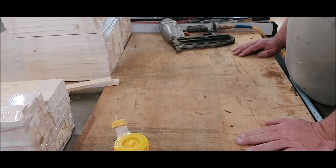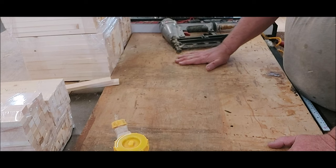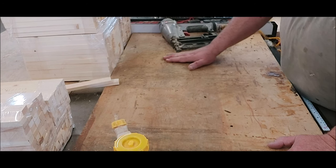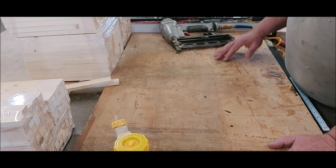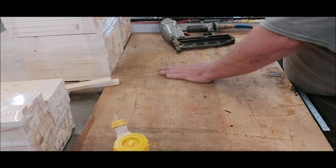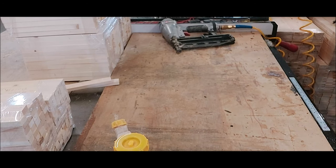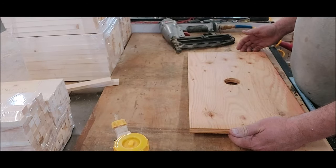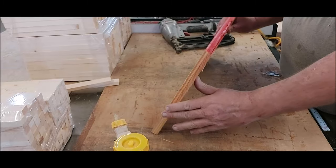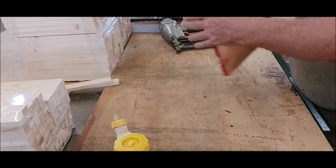Okay, I've got my sacrificial work top here, just a piece of plywood that I use. I like a surface that's flat and not a lot of glue knobs sticking up on it. There get to be drops of glue that stick up, so I've taken my chisel and scraped it fairly flat. The very first thing I do is assess what's the nice side. I painted these orange, that's Kubota orange, on one side, and I want to start with the good side down.